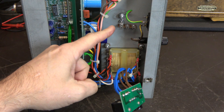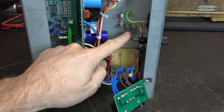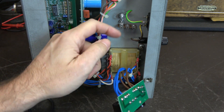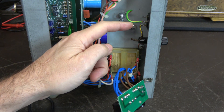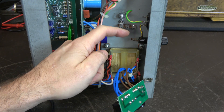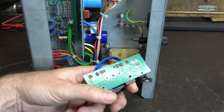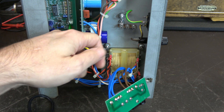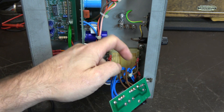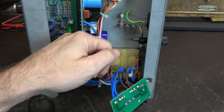There's how I mounted the little terminal board. Now when you hook up your capacitor, make sure that you use the two terminals that are insulated from ground, or that could be a disaster. This is my ground runner — I already have that soldered to the socket. I had to add this brown wire going over to the fuse holder because that used to be handled here on the circuit board, and we don't have that anymore. So you do have to connect your fuse holder. Now it's time to hook up the brown wire and the blue, get the cap hooked up and swing those other leads up there.